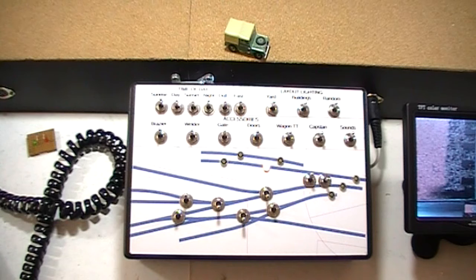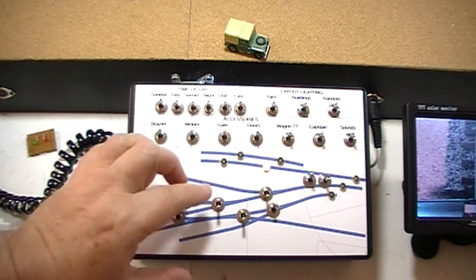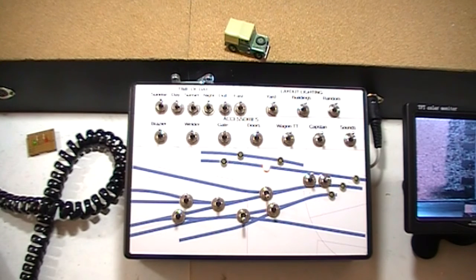For all control other than track power, this is the control panel, which relies heavily on MERG electronics — particularly on the CBUS system. If you go to merg.org.uk you can find out lots about the CBUS system, and don't forget to download Davy Dick's excellent book on electronics for model railways; it's free even to non-members and has a really good section on CBUS. As you can see, we use a mimic panel and the points are controlled by the switches shown in the positions they occupy — click one and you can hear a point change, click it back and the point changes back again.